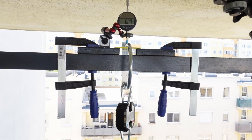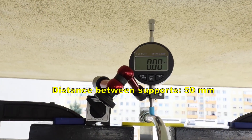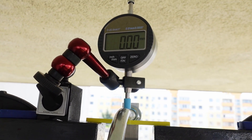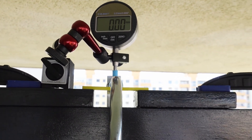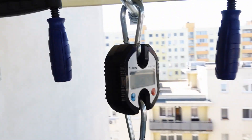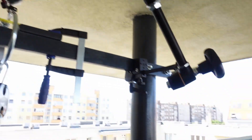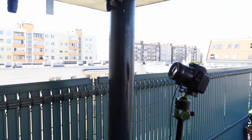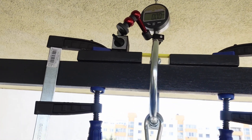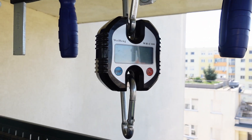This is my test setup for the bending test. I will measure the deformation with this dial indicator. It is a three-point bending test based on ISO 178 — not perfectly the same but similar. I will measure the deformation and the load and record everything with two cameras and try to synchronize them. I will record the load at two millimeters deformation and also register the maximum load.